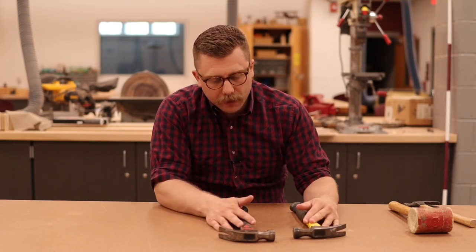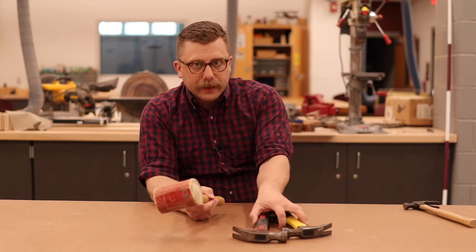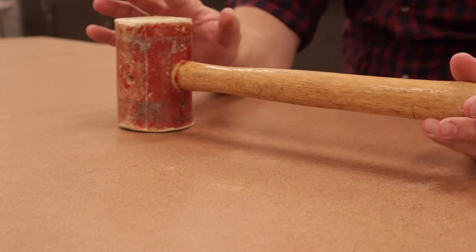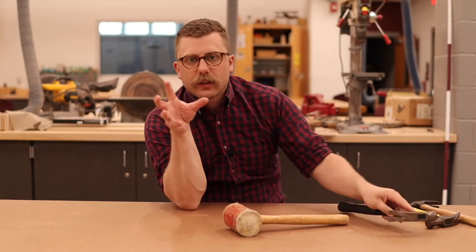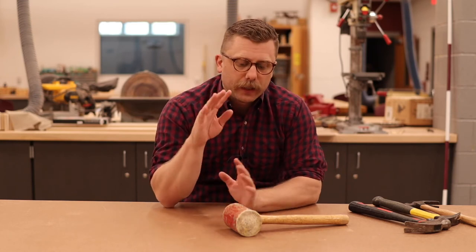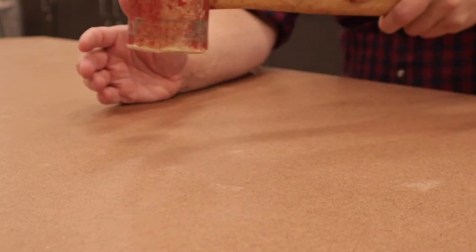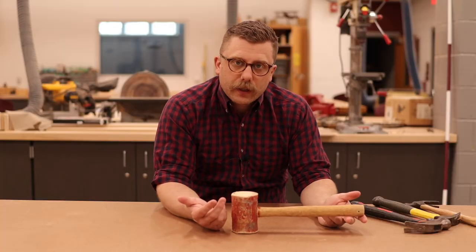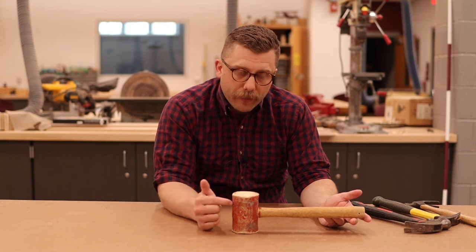And like I said, there's a ton of things you do use a hammer for, but as an alternative, not a tool that I think everybody needs, but is certainly nice to have, is a mallet of some kind, rubber mallet. This is not meant for nails. If you're trying to hit something steel into something soft, like wood, you're gonna put a dent in it. You're gonna damage it. You don't wanna do that. So you get a softer material that you can then tap the wood or hit whatever it is you need to work with, and then you have less risk damaging the workpiece. If you try to hammer a nail in with this, you're gonna damage the mallet, no good.